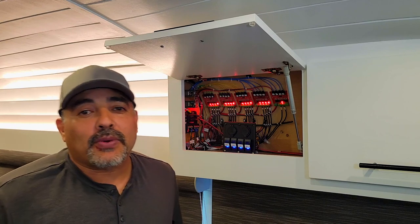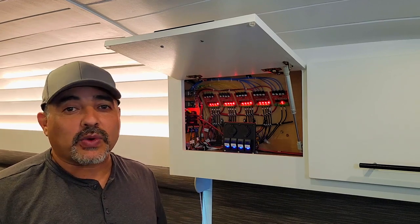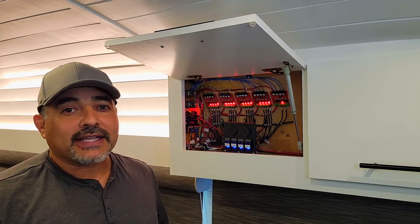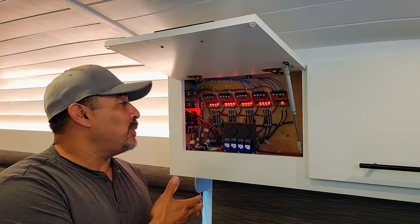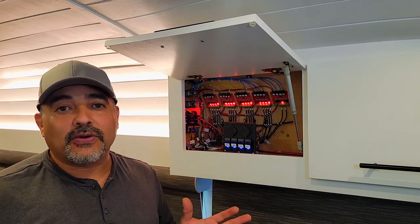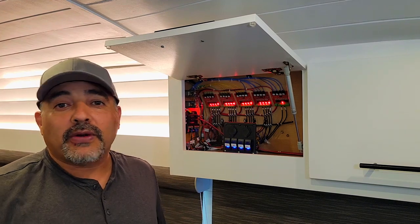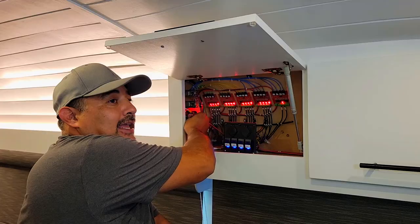I did write a couple other auxiliary programs that would just test the switches to make sure that everything was wired correctly and working as we thought it would. And of course, I tested all that stuff, but we were in a hurry to finish the bus, and this became a relatively low priority. So we lived with just having the lights on full bright anytime we plugged in the little fuse for about 6 months. And so we would just use the little fuse block like an on-off switch.